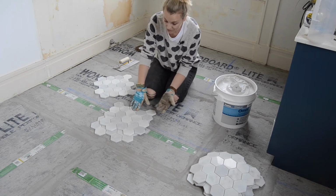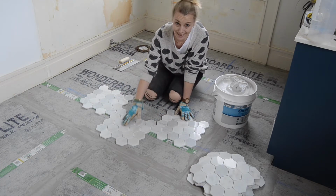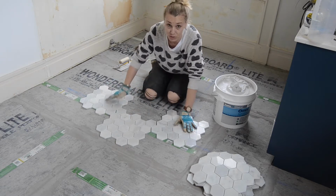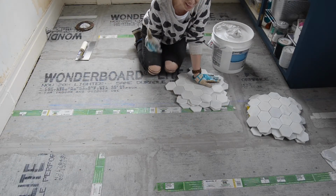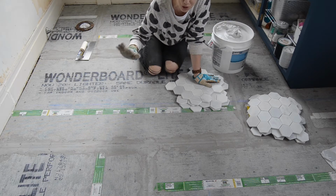The next thing you want to think about is the tile that you're using. It may have some variations in the material. Some marbles, for example, there's a big difference between one box and the next, so it might be smart for you to shuffle the different boxes so that you don't notice the difference in materials quite as much. I suggest you dry fit the entire floor to make sure everything fits, you like the way it looks. Don't get into any adhesive until you're sure that it works for you.